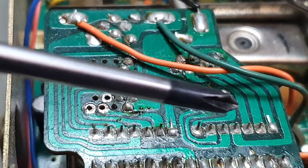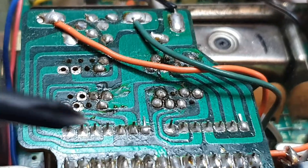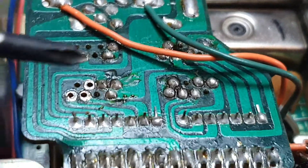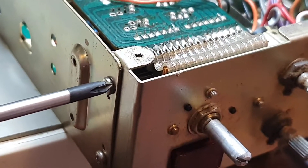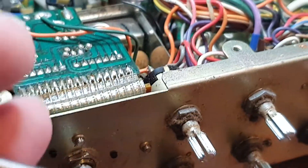On the Mark One chassis there are pins on the top and pins on the bottom of the board that I need to desolder. I'll go through and desolder those, flip the radio, desolder the liner pins underneath, and loosen the screws on both sides so we can tilt the panel forward.